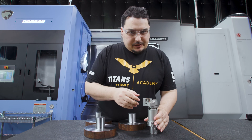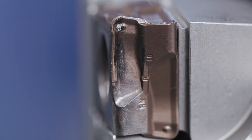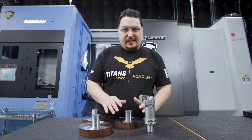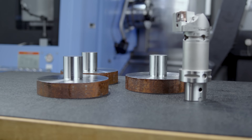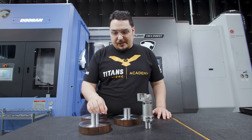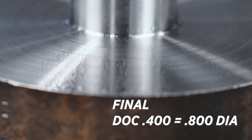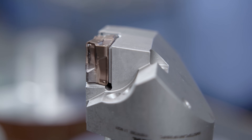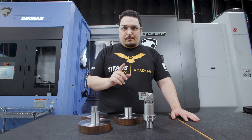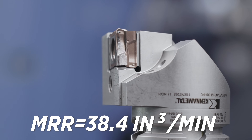The third part came out great — insert still looks good. We were able to do three parts with the same insert, same corner, and it really doesn't look any worse for wear. I could totally get another three parts or more from the same tool. For all three parts I ran it at 800 sfm with a chip load of 20 thousandths per revolution, and I did a variable depth of cut to ease off the torque. It started with a 200 thousandths depth of cut and every pass increased up to a maximum of 400 thousandths. Those speeds and feeds put us at an MRR of 76.8 cubic inches per minute at maximum depth, and even at the minimum depth at the start of the cut we're still getting a respectable MRR of 38.4 cubic inches per minute.